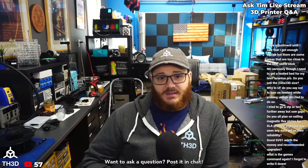Jesse Spark says, I'd really like to get Unified installed on my CR10 V2, but I get an error when I try to send the firmware. Is there anything I missed stepwise? The main thing with that printer is that it already has a bootloader with that board, it's a 2560 chip. So if you're using Unified 2, which you should be, since that printer supports Unified 2, you might have to specify your COM port, and you might also have to update the drivers for the printer on your computer itself.